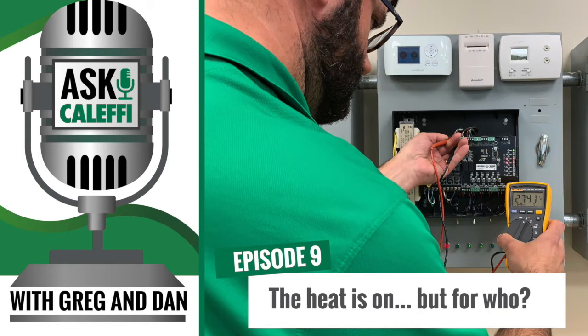That reminds me of a call I had last week. There's a contractor out in Minnesota who had one of our zone valve relays, our ZVR boards. He was using our valves and they were new valves, new board. He was calling to confirm that our board had shorted out and he needed to run to the supply house and pick up a warranty board. Before I just gave him the okay to do that, I started asking him some questions and pushing him through some steps. He tried resetting the power and the board wouldn't come back on. So I had him disconnect all his thermostats and all his zone valve wiring — just a plain board, no low voltage wires connected. He reset the power, and lo and behold, the board came on. The power light was on; the board was working.